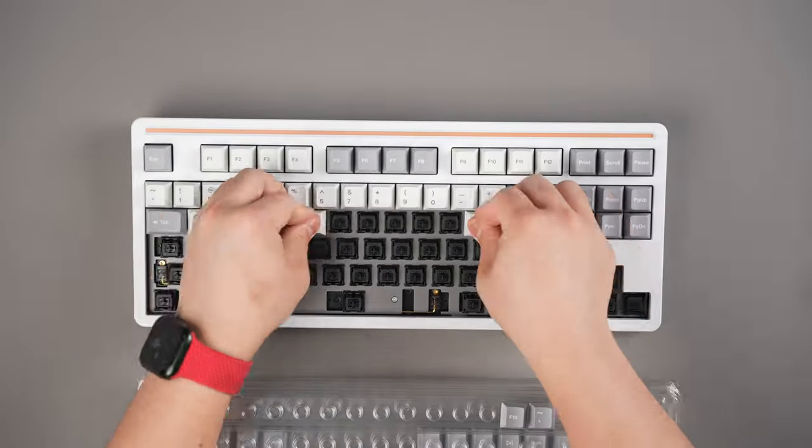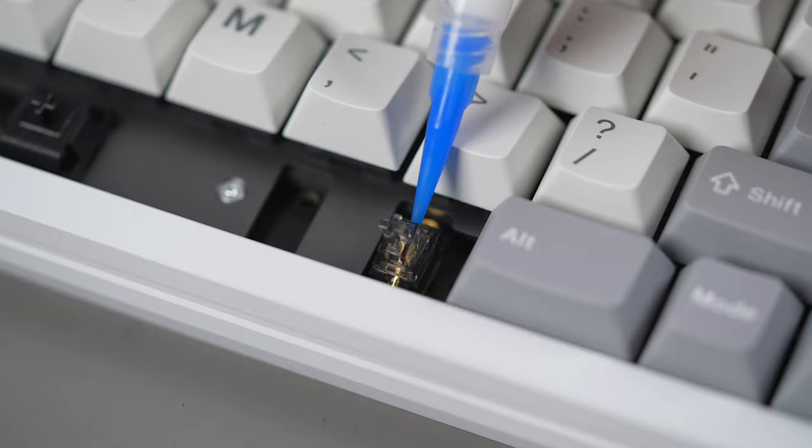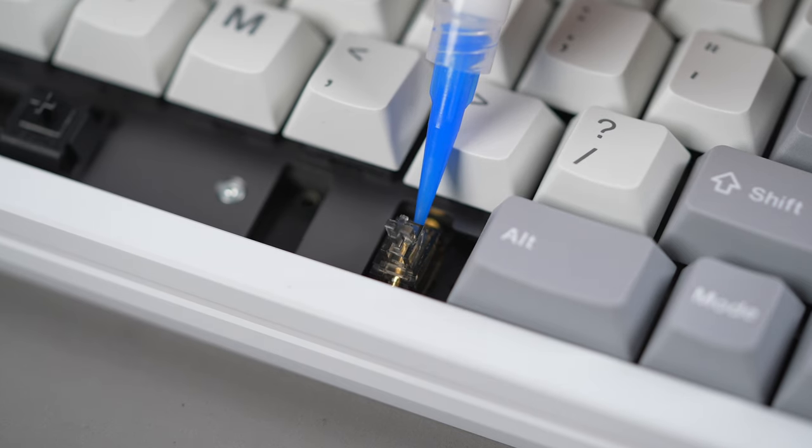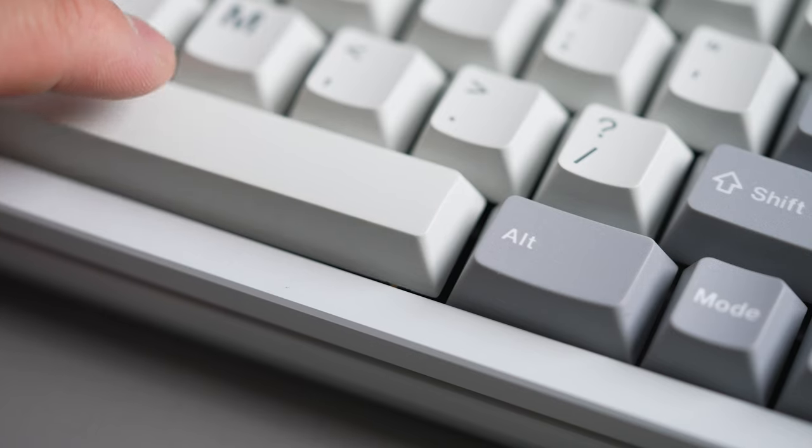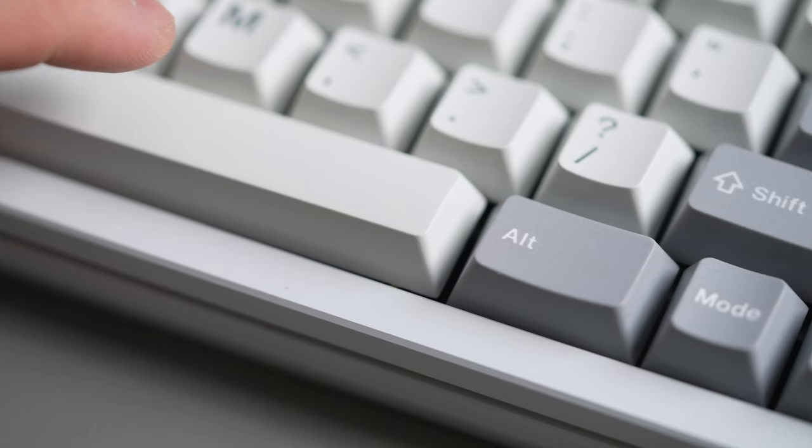Finally, install your keycaps. You can also check for any ticking on your stabilizers and, if needed, tune your stabilizers by using a lubricant syringe to inject some Krytox 205G0 into the rear of the housing as needed. Be careful not to overdo it and use just a little bit of lube at a time. Again, we'll leave a link to our stabilizer tuning tutorial in the description down below.